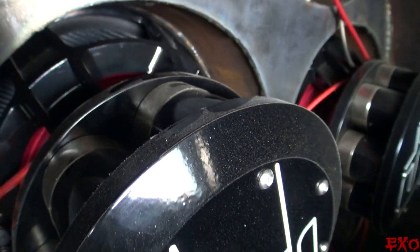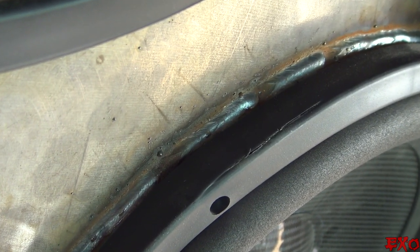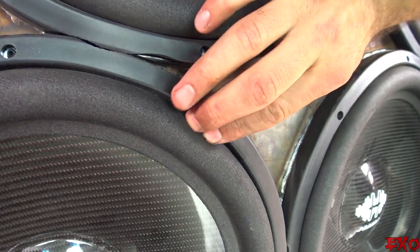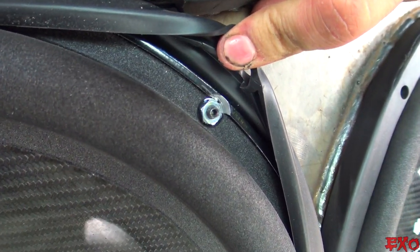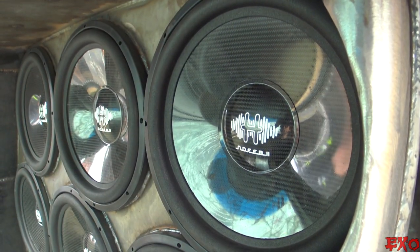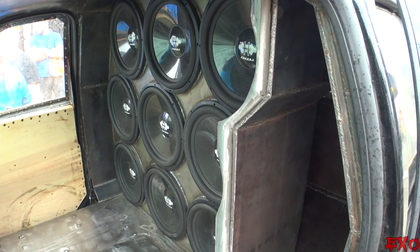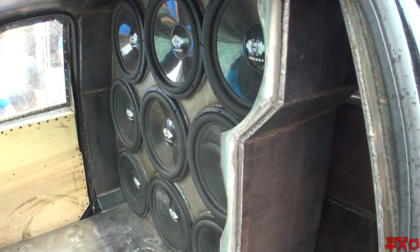That's how you've got that inner layer in here by welding this. That's actually a really interesting thing. There's actually a three-quarter-inch long set screw up there, so it's like putting a wheel on a car — there are studs, and then you just put the nuts on the studs. Right now we're running nine of our NDF-EB2 four-inch coil versions that we just came out with. They're a 4,000-watt neo sub that we make.